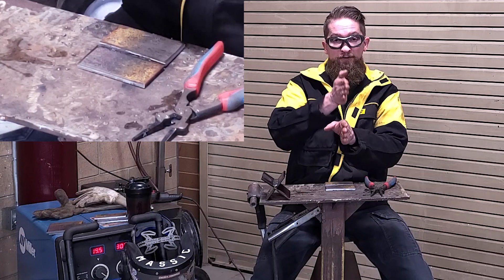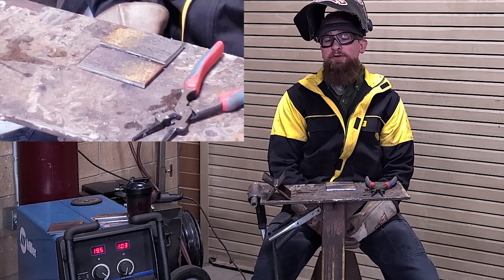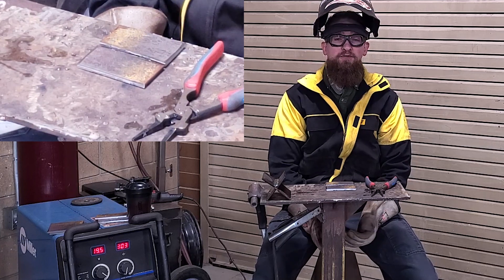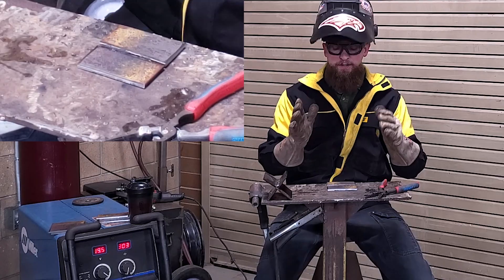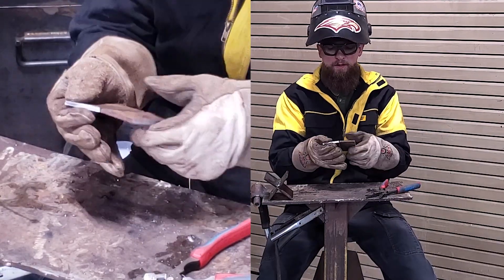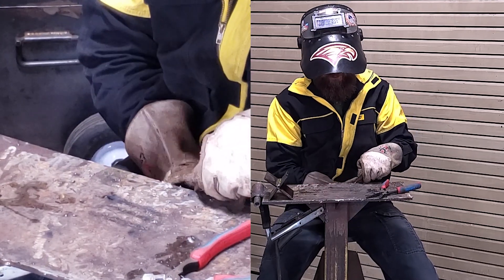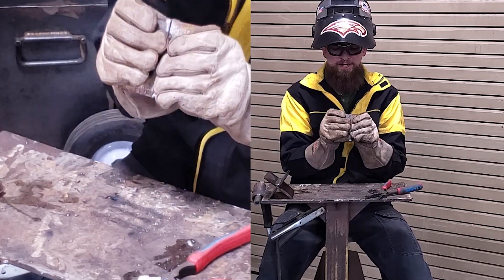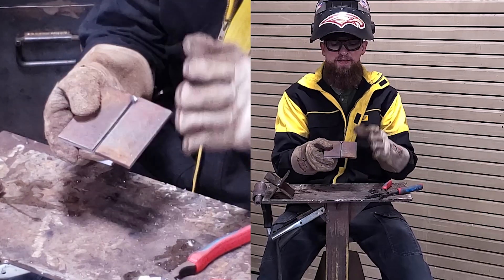We really don't want an offset or a twist. It's very important that you take the time to tack these joints perfectly flat together. I would keep the same settings that work for you on the flat butt joint for this horizontal one — those quarter-inch and three-sixteenths settings on the chart. Make sure it's flat. Now that we have it tacked together on one side, I take the time to open this up or bend it a little bit if I need to.